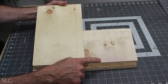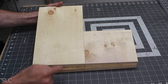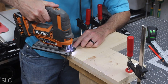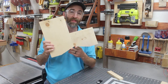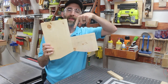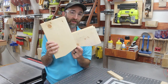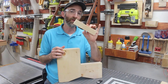You can do this with a hand saw by cutting a triangle into it, or a jigsaw to cut a circle, or a hole saw — whatever you'd like — we just want to minimize some of that footprint. Now, with the footprint reduced, if a lot of weight is put directly in the center there's a chance the boards could split apart. To strengthen this, I looked at the cut-offs and found a little wood left over.